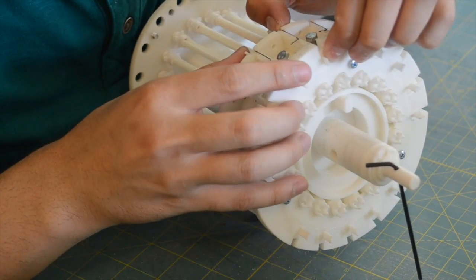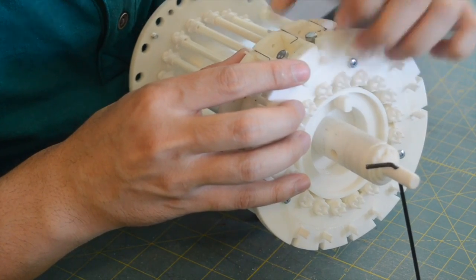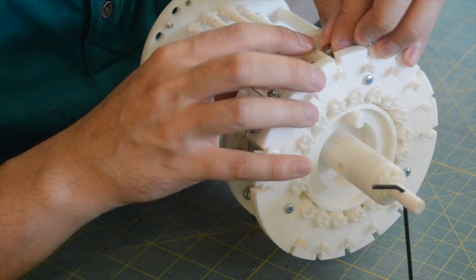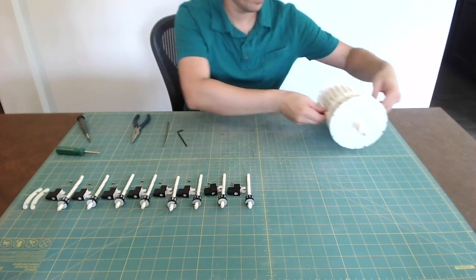Another reason the carry levers may fail to reset is that the carry lever springs might be too tight, creating too much friction, or aligning too high or too low on the carry lever. Adjust the springs as necessary.